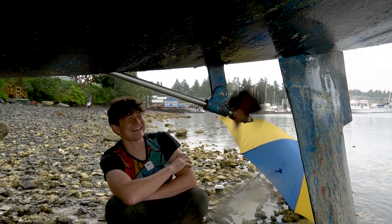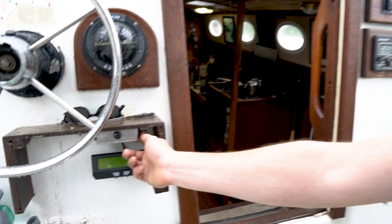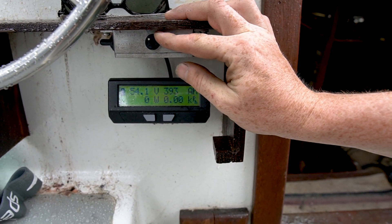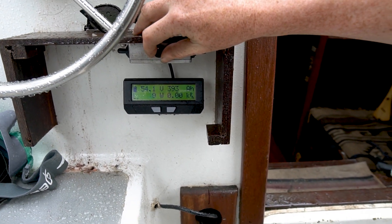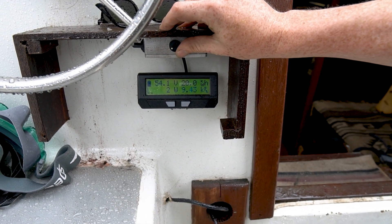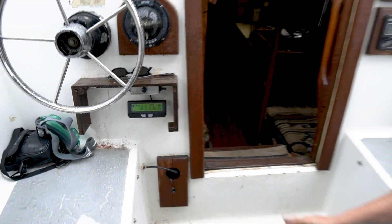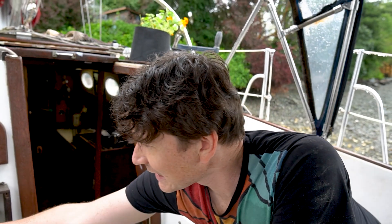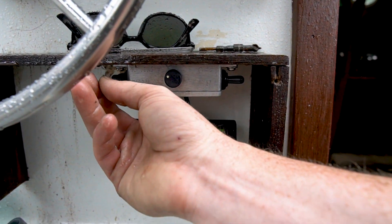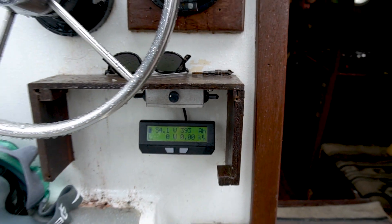Toni's sailboat is set up with the simplest option for controls: two switches and a dial. The switch on the right is an on/off power switch. The dial controls motor power — cranking it up spins the propeller faster, and spinning it below a set point switches into regenerative braking. On the left is a switch to change between forward and reverse. We mounted waterproof boot toggle switches into an aluminum box.